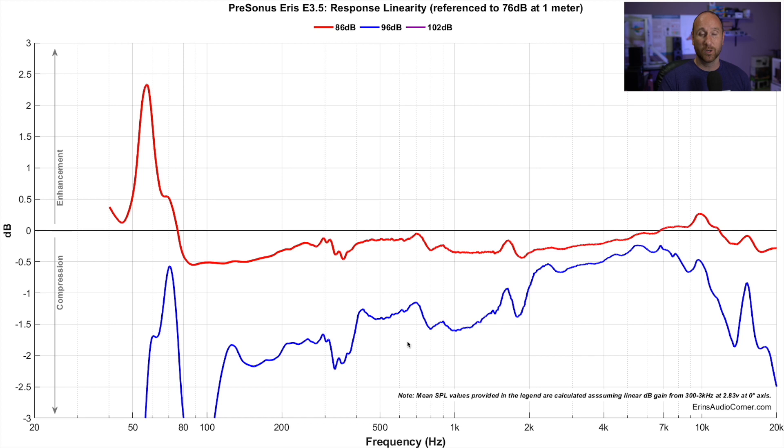You've got to use your brain here. This speaker is meant for near-field monitoring. It's a hundred dollars a pair with a three-inch midwoofer and a one-inch dome tweeter. You're probably not going to be listening to it any louder than about 80 dB a few feet away. You wouldn't buy this for far-field home theater listening. But it's good to have this data showing the limits, because if I wanted to compare it against a similar-priced or similar-sized speaker, we'd have this data to make that comparison.